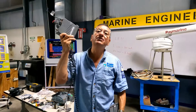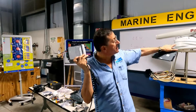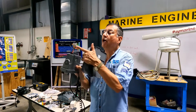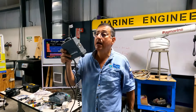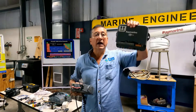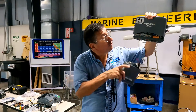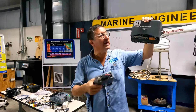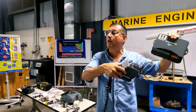Pay attention. This radio is NMEA 0183, and my NMEA backbone is 2000. However, I have the option to connect the data cables into the NMEA connectors on the autopilot computer. Can I connect this radio to the NMEA options and have it integrated in the backbone? Yes.